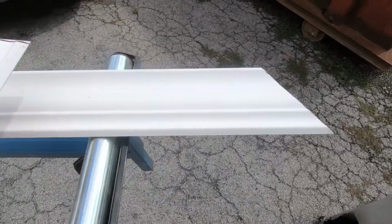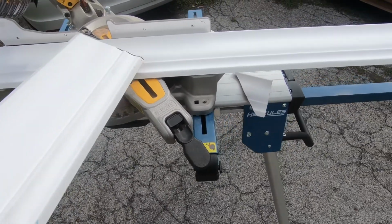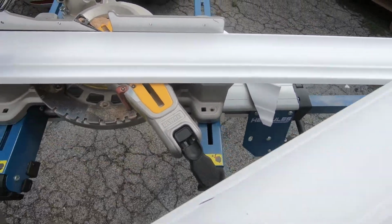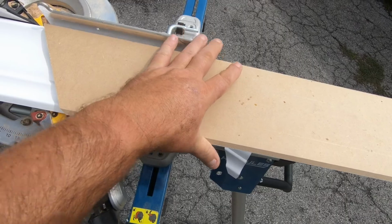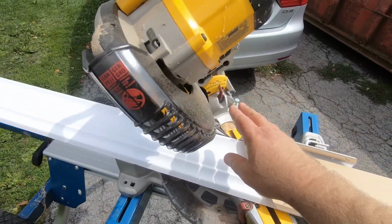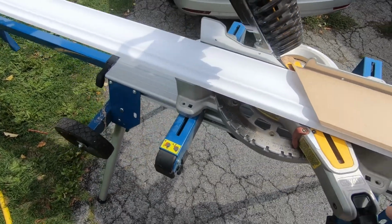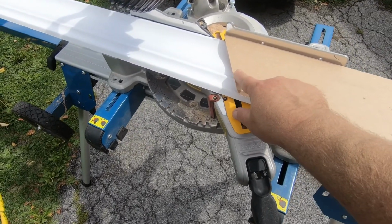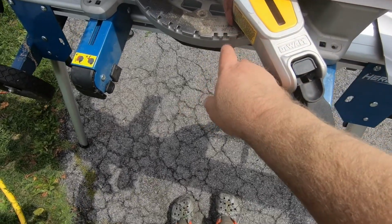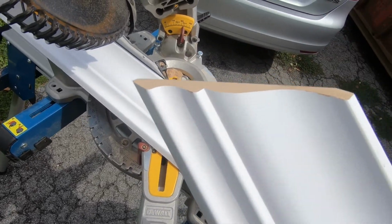Now cutting the one for the right corner, you cut it this way. You cut it paint up on its back. This is the bottom, of course. If you want to do the left side, you got to cut it upside down. If you have just a single bevel saw like this, cut it upside down at the 35 degrees or whatever, or if you're using the 31.6, just cut it upside down, and that'll give you that cut right there.